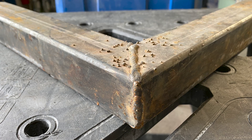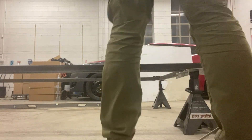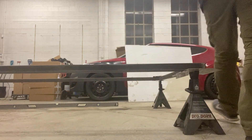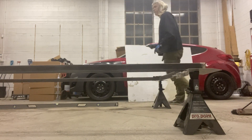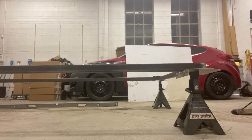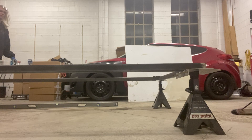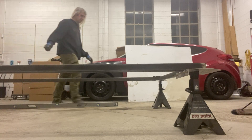At this point I'm feeling much more confident with the welder and you can see that in the work that I've done. I had cut the four pieces of steel for the outside of the frame and I was preparing to weld them together. I put them on jack stands to get them absolutely level. You can see a large long level that I used in the background on the ground, and I used pieces of steel to shim them up so that we could get it absolutely level. Then it was just a game of trying to make each corner match.